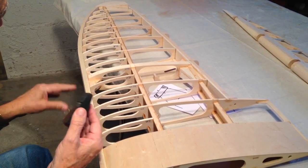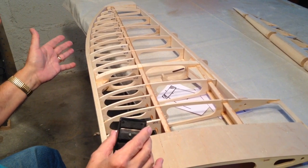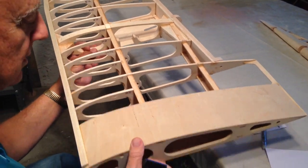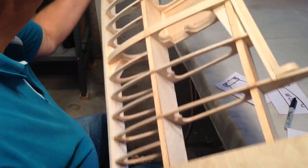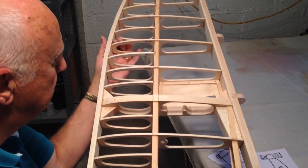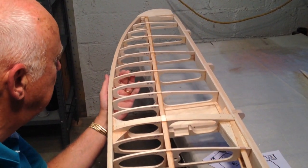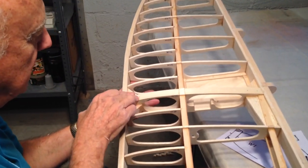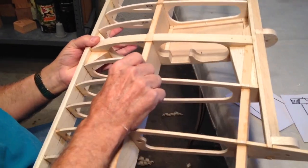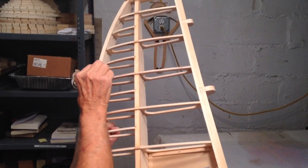The hardest part of shaping the wing is that it's big and somewhat unwieldy. You've got to train yourself to grab it at W9, or you can grab it at W1 or up at the wing tip. These are balsa wood ribs out here, so you wouldn't want to grab the wing at W13 — that would be a mistake, it's going to break. But W9 is not going to break; it's all three-quarter inch basswood. If it does break, you'd better rethink what you're building.